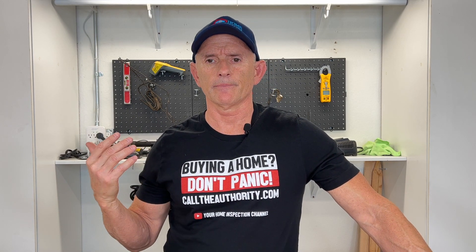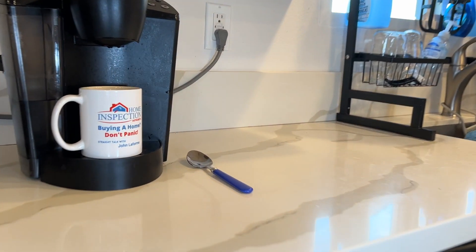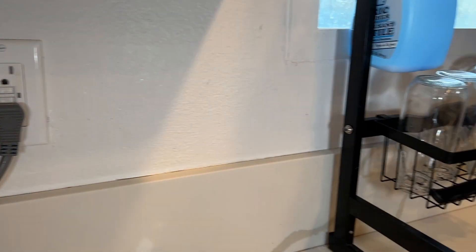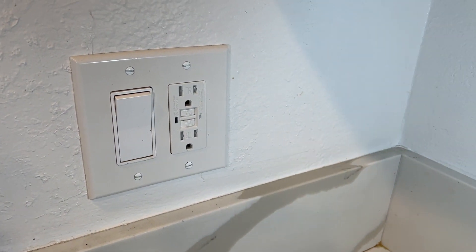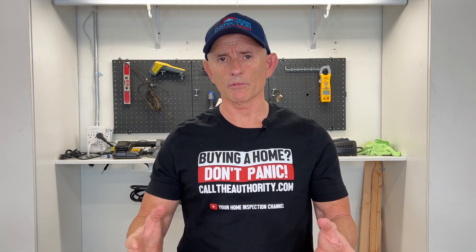So you're probably wondering: what parts of your house should have a GFCI receptacle? The main place for a GFCI is in a wet area — within a few feet of a wet area. For example, your kitchen sink: receptacles on the left and right side of the sink should definitely be GFCI protected. If you have an island in your kitchen, you want that protected as well, especially if it has a sink. Another area is the laundry room — some have a laundry sink right next to it, so any receptacles in that area should also be GFCI protected.